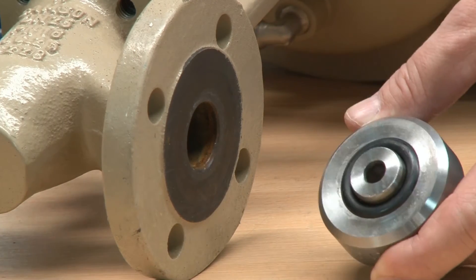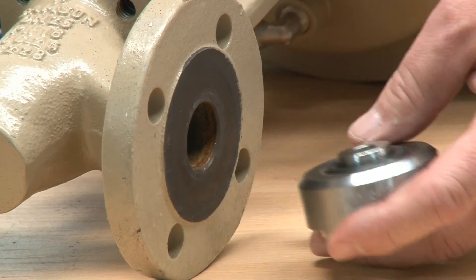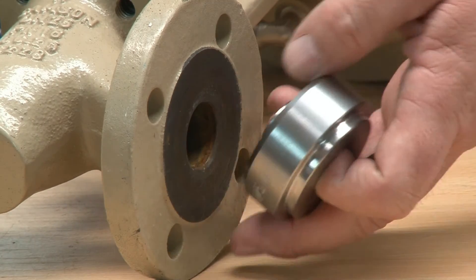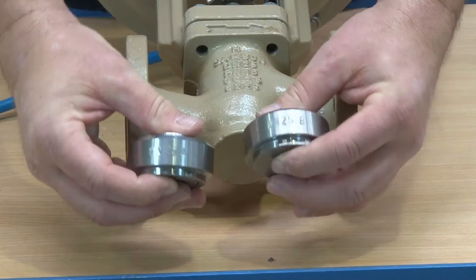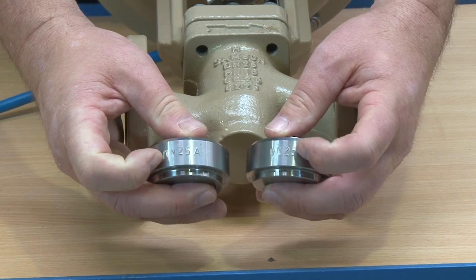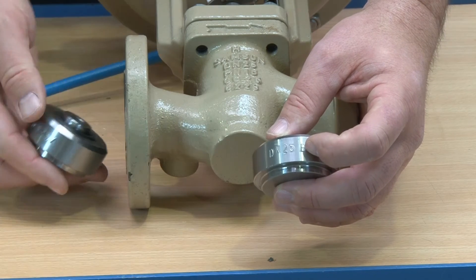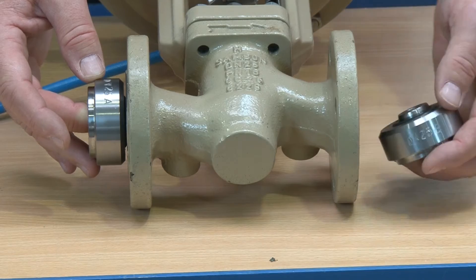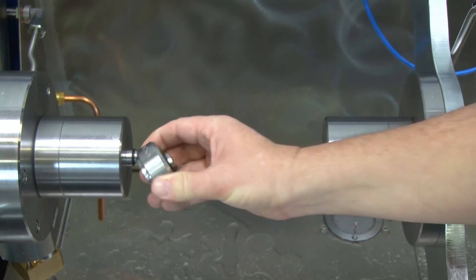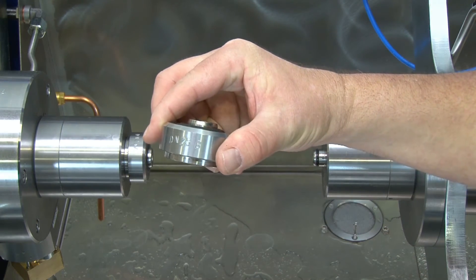For the clamping of the valve we are going to use our automatic sealing heads. Please take care that you use the right diameter — you can also check manually that the sealing will properly seal at the flange side. Always use automatic sealing heads with the same diameter; it is marked on the heads themselves. There is also an A marking for the active side on the left-hand side and B for the inactive side on the right-hand side of the test bench.